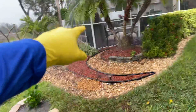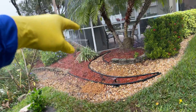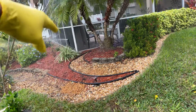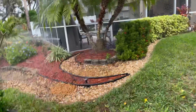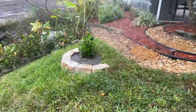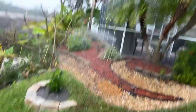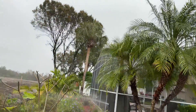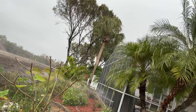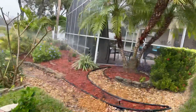That rotary sprinkler on the far end — I don't really advise this kind of setup, but since they're already using it, I would put that rotary in the corner and eliminate these two sprinklers here. That rotary can come around and cover this whole section. So we can cap off two sprinklers here. Zone three recommendations: cap off two sprinklers and relocate one sprinkler.